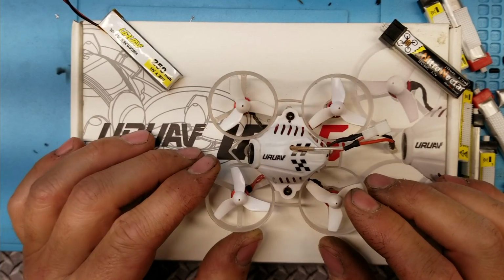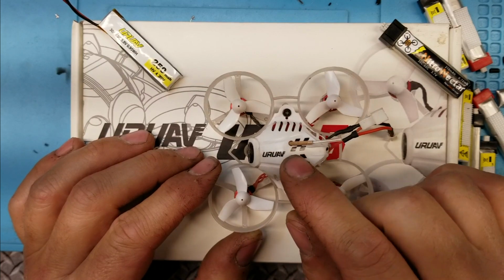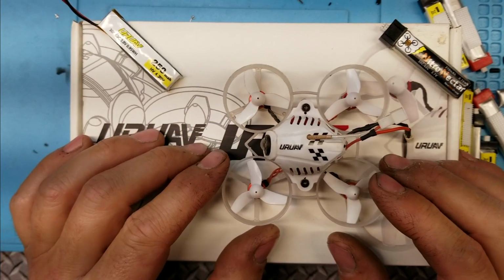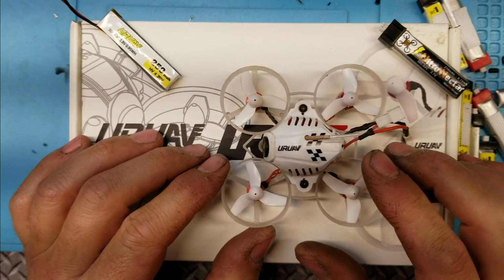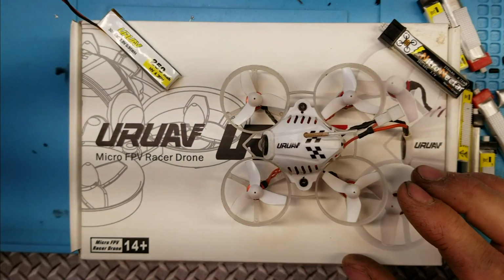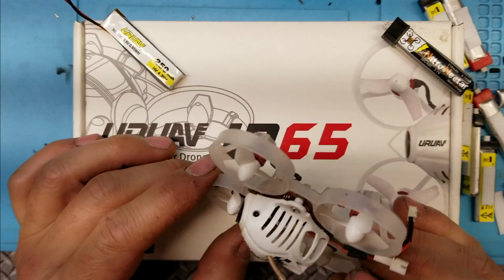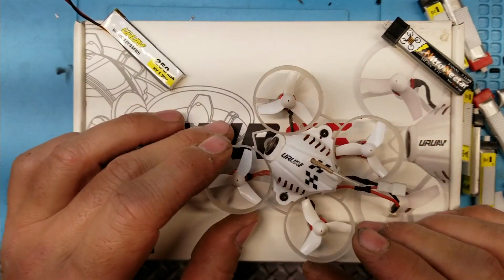It is super clean here in the home. And it's definitely not the Rapidfire. However, when it was shipped to me, I was only getting about 10 feet, and it would drop out. I wasn't getting any video anymore, and it was the channel that it was set on. For some reason, it was set on a channel that even my old trusty Boscam monitor couldn't pick up, and this thing picks up everything. So I just changed the channel to 5780, and it seemed to fly just fine. I was getting pretty damn good range. Like I said, here in the house, it was super clean.